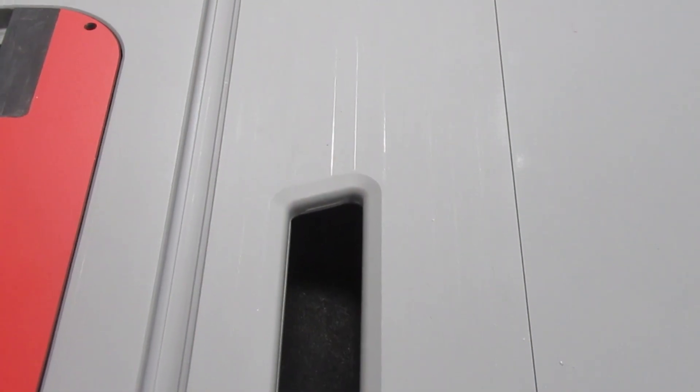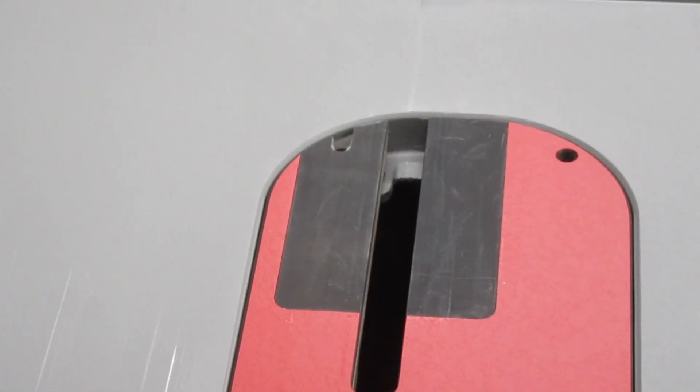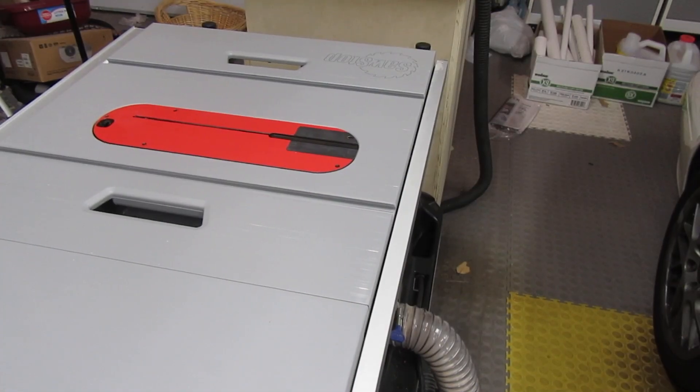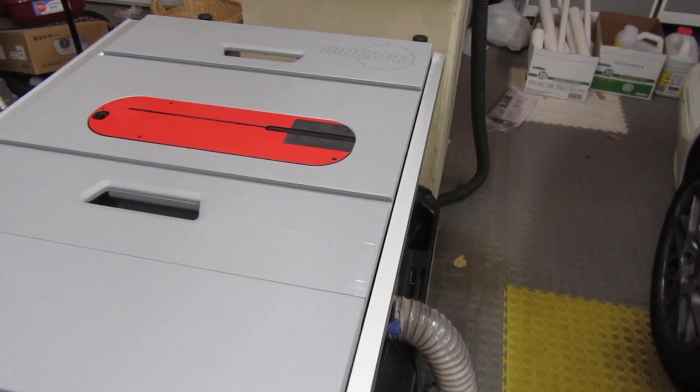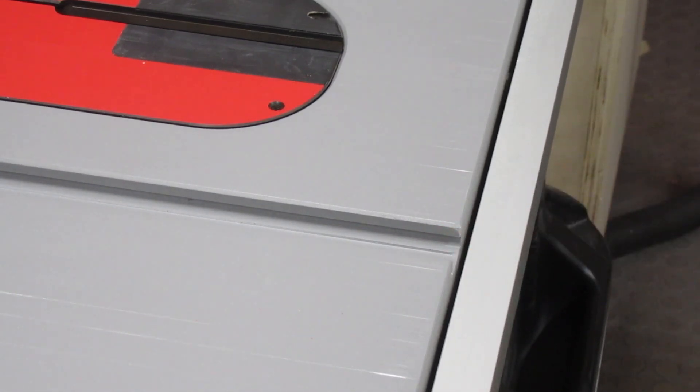Here are a couple of the problems I've encountered. First, the top scratches too easily — this is actually just a cosmetic thing, because the scratches are hardly noticeable to the touch. Second, the right miter track was pinching a little at the far end, and I had to file it a little to fix it. The top itself is pretty darn hard, because it took way more effort to file than I thought it would.